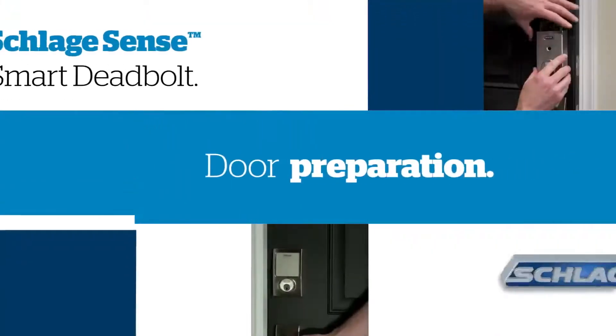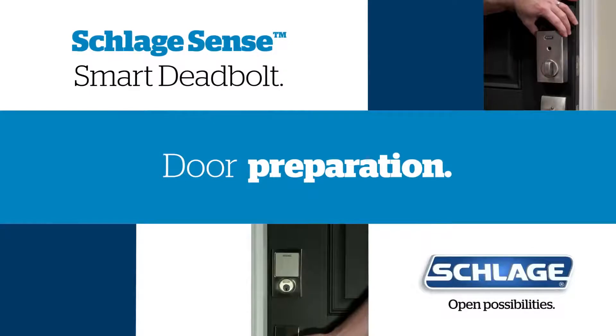Now we're going to create a checklist of the questions we'll need answered. If you can't check off everything on the list, you may need to make some adjustments to your door or frame. Let's start by taking a look at your current door and frame to make sure they're properly aligned and that the holes are properly drilled for your new lock. Because your Schlage Sense has an automatic motorized deadbolt, it's important that the door and jamb are properly aligned.